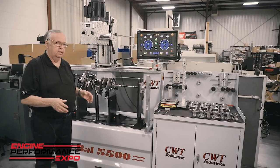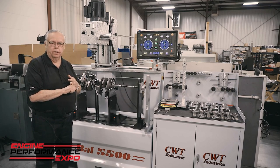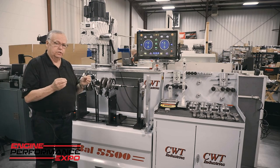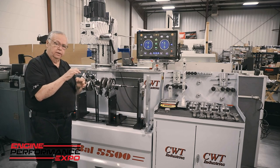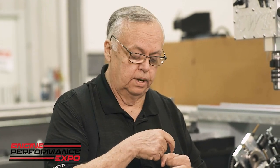It's an unsafe idea. And the number one reason is the mass density of your Mallory, which is a trade name, it's really tungsten, and your base product, well, I don't care if it's a 4340 or 8600 series, the deal is the density of expansion and contraction requires proper press fit. So when we see technicians going and starting to do welds around there, if they'll follow that weld and study it, they'll see a micro crack follow it. Some guys will tack it. What you should do is understand proper press fit.